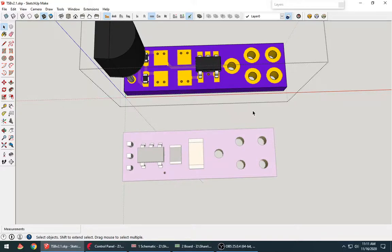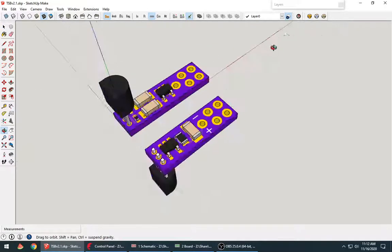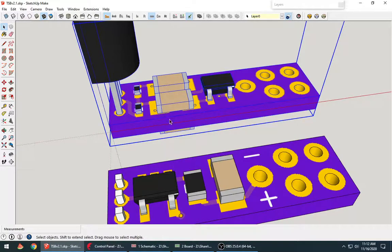But I just wanted to get these done, hurried up, and built 9 of them, as I explained in the other video. So, general update video. And it didn't work, but that was not the only problem. This sensor was the MCP9700. I don't think it was able to handle these large capacitors. I think the series resistor is just limiting the current, whatever, but it wasn't working.